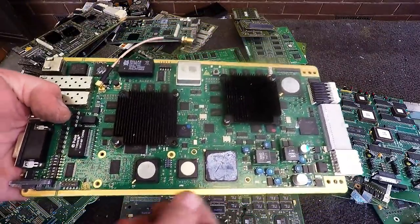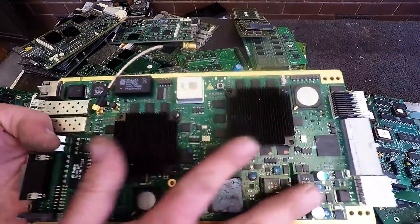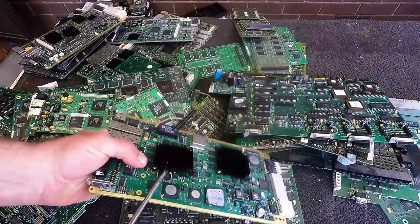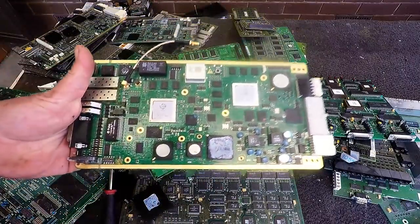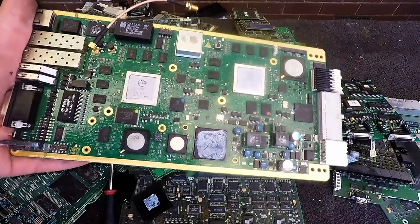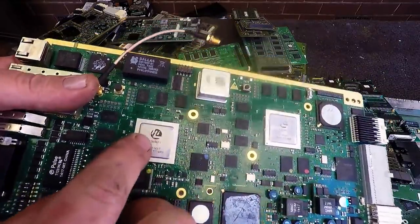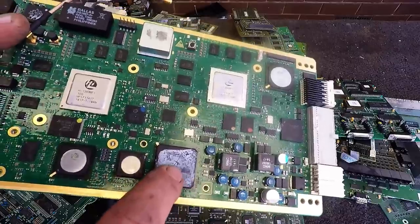These ones, again, we're not grading because of gold foil. They can be on mid-grade boards. They don't get anyone excited. We've got heat sinks here, so it's going to be hard to grade this as telecom unless you remove them so we can see what it looks like. So we pop them off, and that's how it should be presented to me if you're expecting very high grade like telecom. In this case, these chips are actually not that crash hot for scrap. They may be great as far as removing them off the board and selling them on eBay as chips, but gold recovery wise, there's very little. That's just a copper top, so these are worth much more than them.